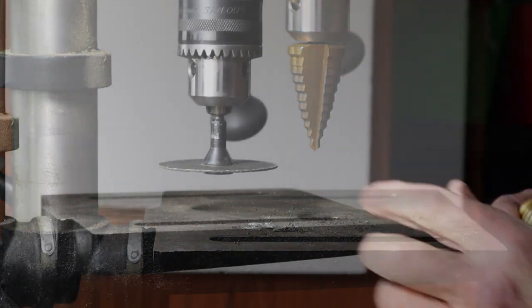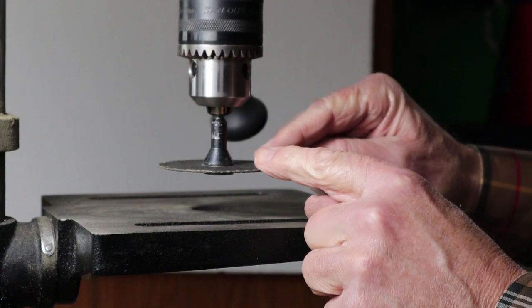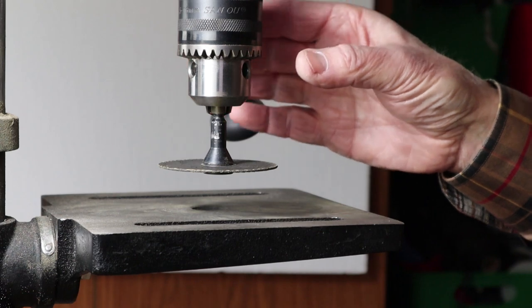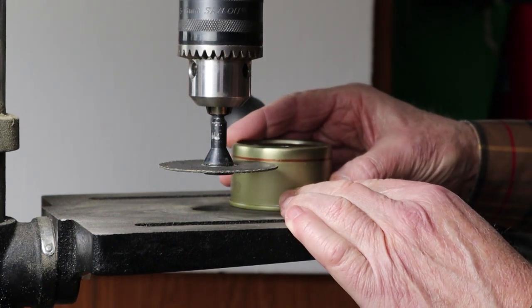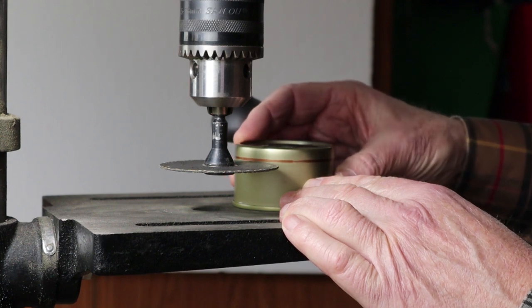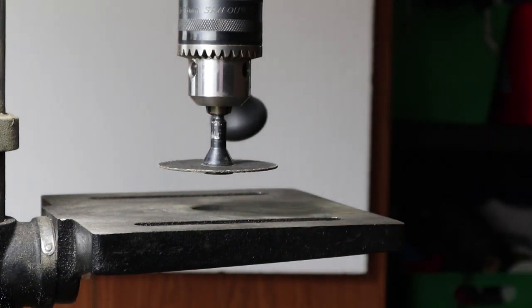Now I've replaced my step drill with the cutoff wheel. These cutoff wheels are virtually identical to those used with an angle grinder, just smaller in diameter, and can be used with either a drill press or a hand drill. I've set the platen to the height where the side of the cutoff wheel touches the cutoff line on the can, and I'll slowly and very controlled rotate the tuna can around the outside until it cuts through. Safety goggles on, hearing protection on — let's get started.